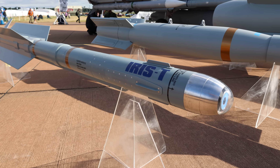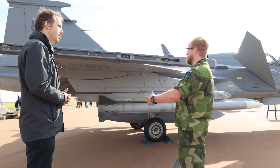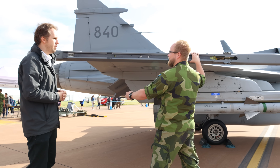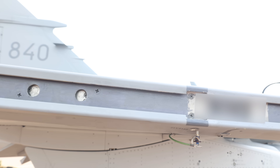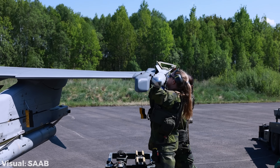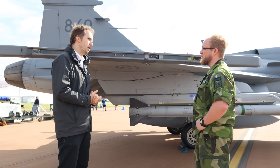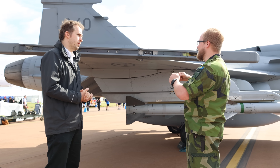You have the missile on a trolley — you're three people: one in the back, one in the front, and one in the middle. The person in the front manages the cable, while the person in the middle is manpowering it — lifting it up. You're trying to fit it into these two guide rails, which are color-coded so you can see where the cutouts are. Then you lift it up, push it forward, and install it. It's easier than the fish hook method because you don't have to install the tower, get the fishing hook line and winch all set — this one you just power up and put it in place.